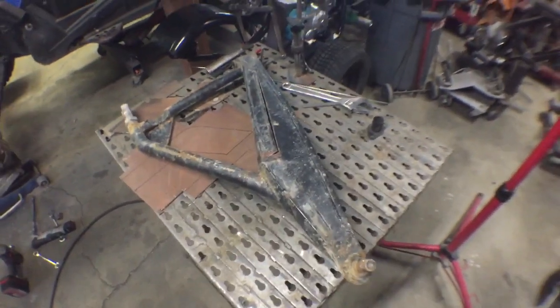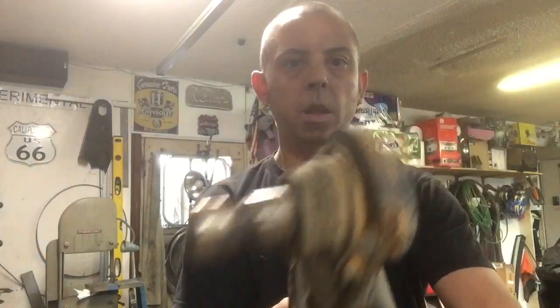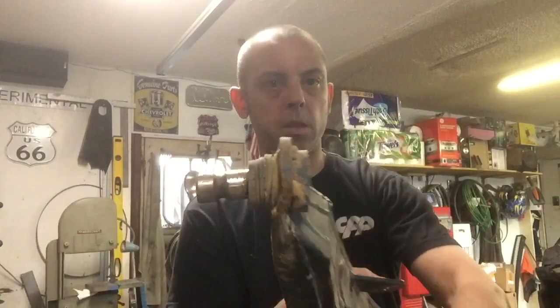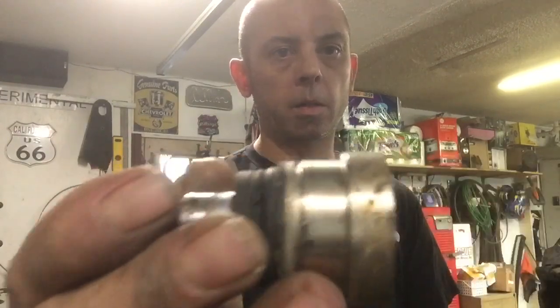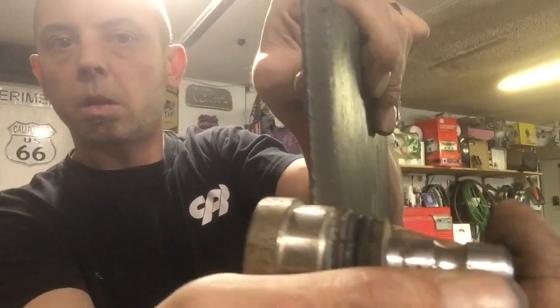So now it's time for Heimlich Hot Rods here to make it bulletproof. First things first, I'm going to work on my mounting points that are going to go on the buggy. Now, they made this one, and I'm not going to reuse it obviously because they welded it on there and it's not even the right thickness of steel for the ball joints. It should really be 7/16ths for the C-clip there; this is 3/8ths — pretty darn close. It's got like 1/32nd of an inch to shim, so we'll worry about that later.